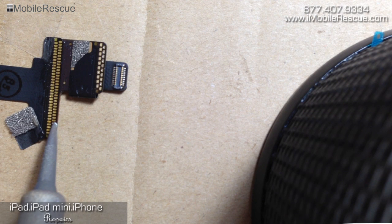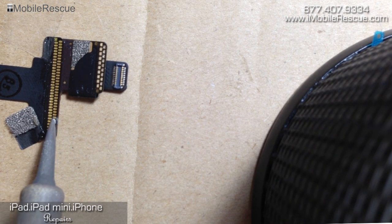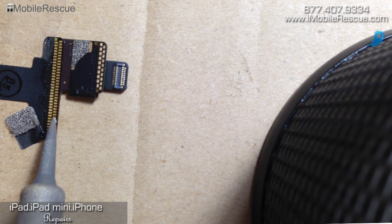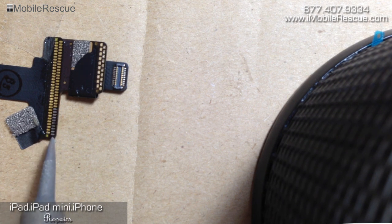As you see, I'm really just dabbing it — pretty clearly, pretty neatly. I'm not smashing into it. I'm applying a little bit of resistance so that I don't press down too hard and damage anything. Now we've got five tracks done. It's really easy, and this is because of the flux. Because I have solder at the end of this iron, it's just nicely and very flowingly transferring the solder. Looking good.